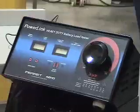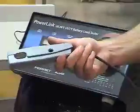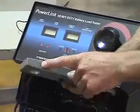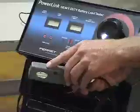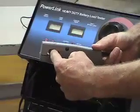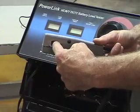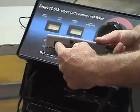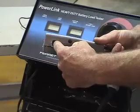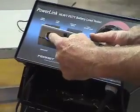The next piece of equipment, part of this unit, is the inductive amp clamp. There is a direction based on current flow, whether it is conventional current flow theory or whether it is electron current flow theory. This gets clamped around the positive connection or the negative connection directly at the alternator, directly at the starter motor, or directly at the battery. All systems should be rechecked to ensure that the applicable voltage is in the areas necessary for a functioning cranking system or charging system.